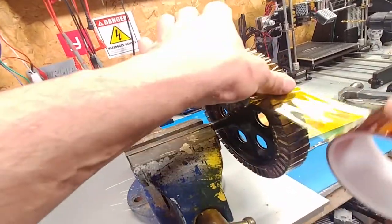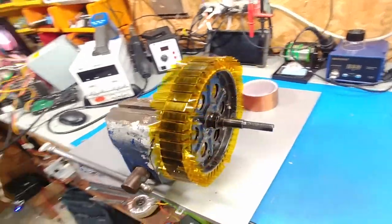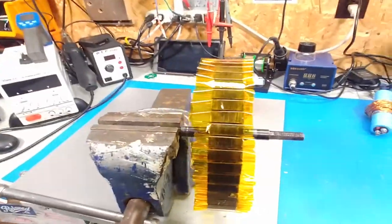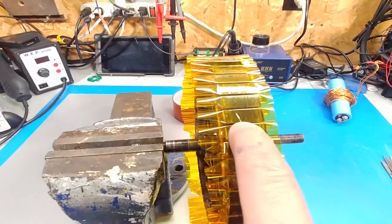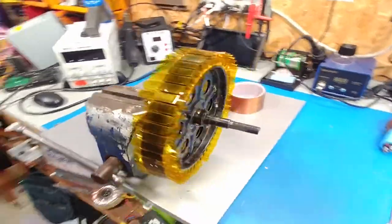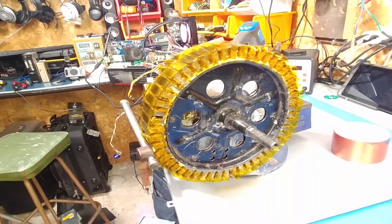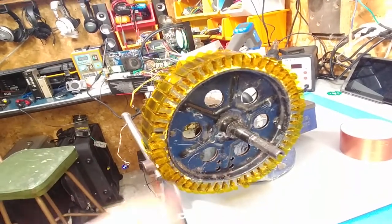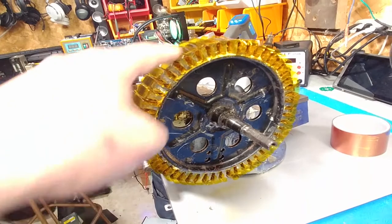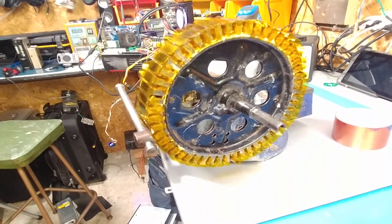Let me get this out of the way and we'll move on to the winding part. All the slots are full now. It will protect the wire going into the slot as well as on the sides, so this will work pretty good. I wasn't too sure if it would work, but I saw a guy in Russia rewind a stator like this and it worked for him. If I have to put another layer on the outside I will, but when I'm finished winding I'll need to peel the outer layer off, or leave it if it fits between the magnets, though I doubt it will — it'll bind.